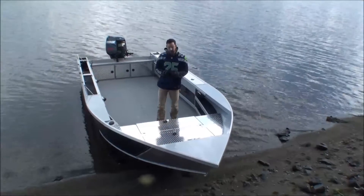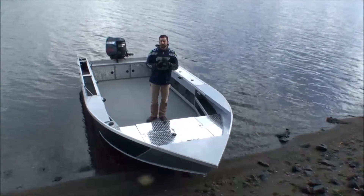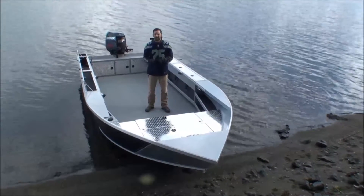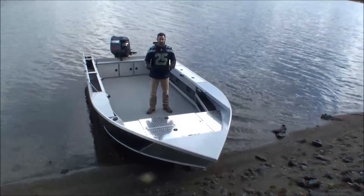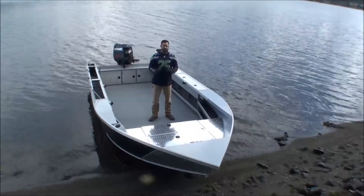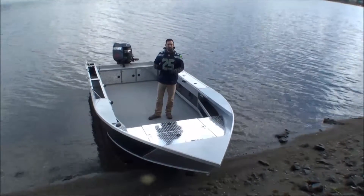It has the Woldridge Tunnel, so it is a super aggressive shallow water handling boat, but we added a few more features to target some bigger water, whether it is the Columbia River or bigger lakes and reservoirs. We went with a very wide bottom — 7 foot 4 inch wide bottom, 88 inches — and it has got an 8 foot 10 inch wide beam. We added some more V without compromising that shallow jet boat ability, going to 12 degree dead rise in the back and 18 degrees in the front. I wouldn't want to go too much more than this, as that would compromise the ability to really run shallow and really run aggressive with our tunnel.